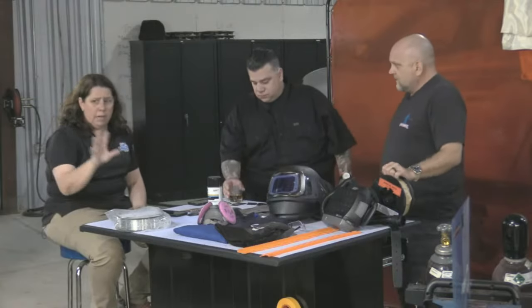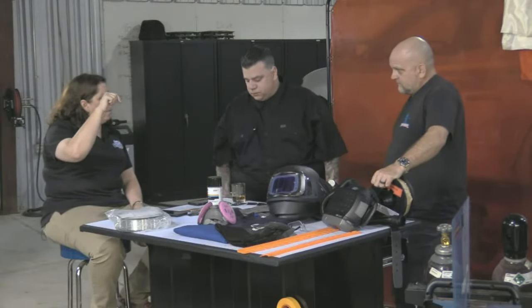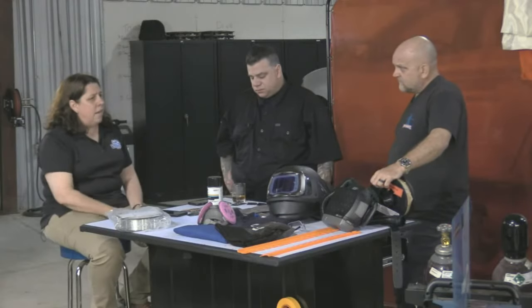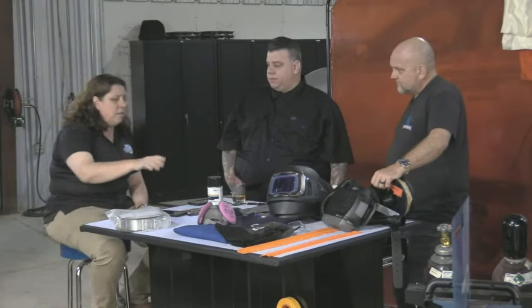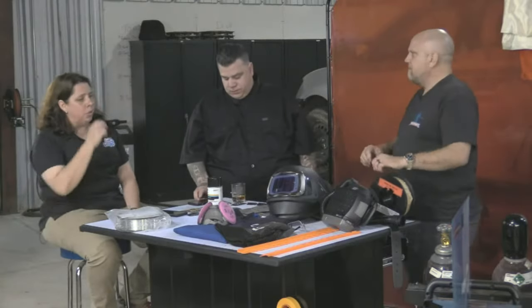I want to say it was 3M, but I'm going to be completely wrong. And if I am way wrong, I'm sure I'm going to hear about it. But at one point we were in a class, and if I'm doing a weld through adhesive, so if we're having a weld bond, the off-gas of that has a small component of cyanide. So there's a reason why respirators are worn, this isn't just a joke. It isn't just an overreach by OSHA or whatever. Metal fume fever, is that what it's called?